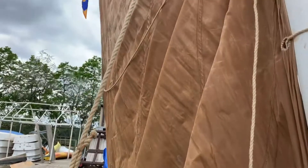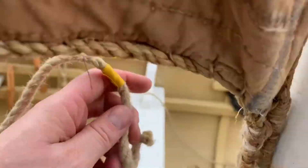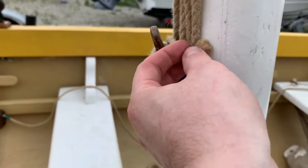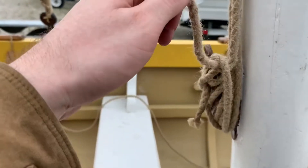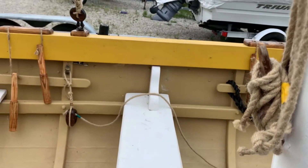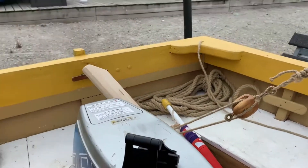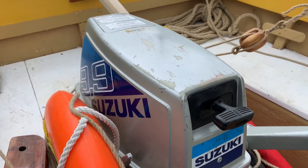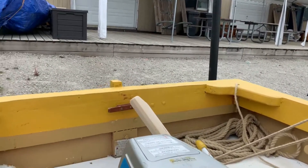I have loosened the brailing line for the main and I'm going to find some convenient place to secure this, so it's out of the way. I've just made sure there's enough slack in it that it's not holding the sail back. You typically want something nice and secure so you don't lose this line, because if you lose it you can no longer bring in the sail. For now, since we're on land, I want to show you how the sheets work with the traveler. If I'm in the cockpit controlling the boat, I'm usually also responsible for controlling the main sheet.